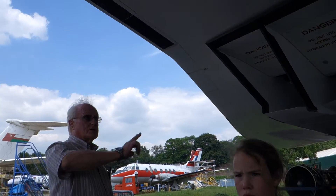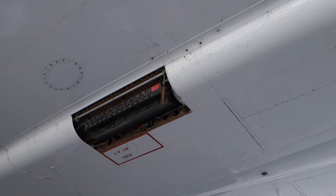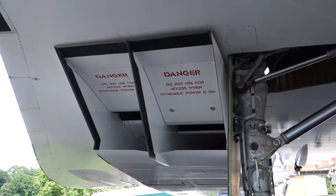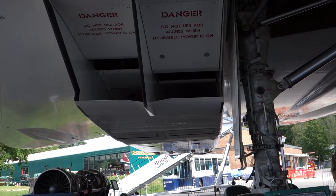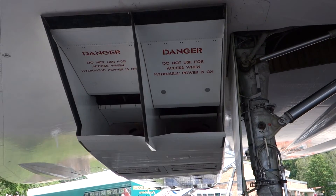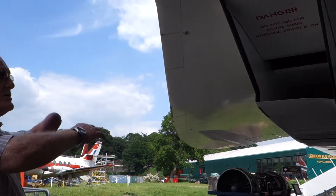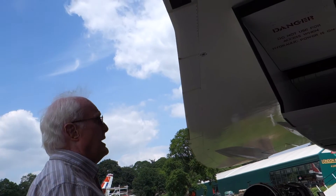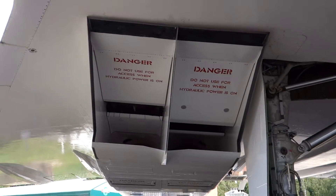Forward and aft of the centre line. Thirteen tanks are indicated above your head there. And the two connections, as you see, Jet A1 fuel here. Now at the intake you can see number 3 is in the high speed mode, as is number 1 and 2. Number 4 is in the take-off mode, so the ramps are up and out of the way, and these oscillate and control the air going into the engine.